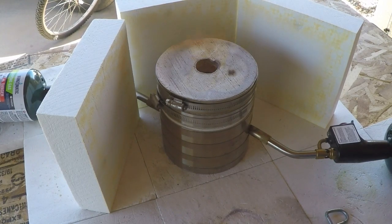And right now our pool of lead is melted, and I can see some of the crust on top of it, but the cupel hasn't opened up. In other words, it's a lot hotter than the melting point of the lead, but it's not hot enough to where it started to convert the metallic lead to litharge and generate the exothermic heat yet. So I gotta wait.